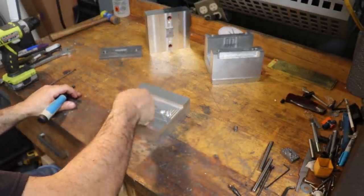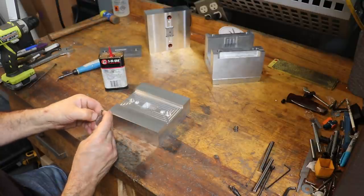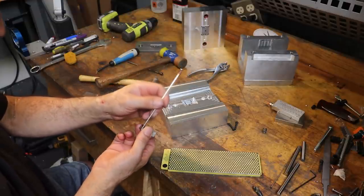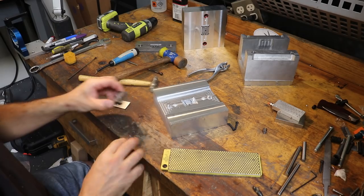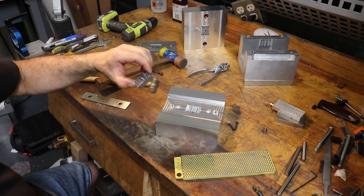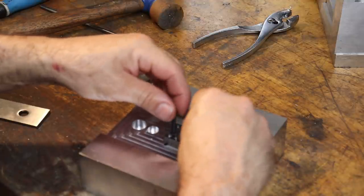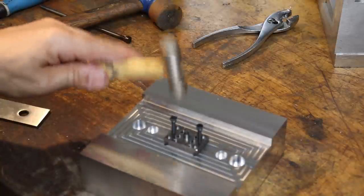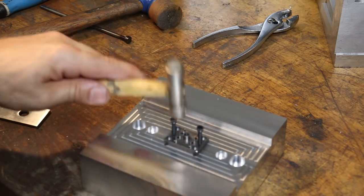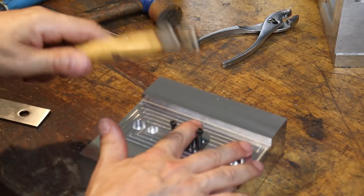And we'll probably actually spray a little household oil onto our insert here, which I think is ready to go. You know, because the more oil we add, the more we got to remove after we've assembled the mold. Okay, and then check the geometry again of the two halves. Let me zoom in. So our threaded holes are actually a nice pounding surface. So now we're just rocking back and forth. All right, so it's starting to align better as it goes deeper and the insertion is becoming more reasonable.